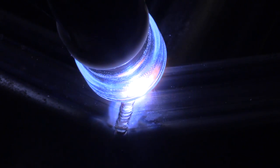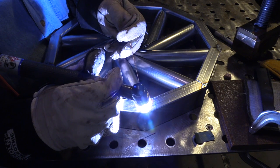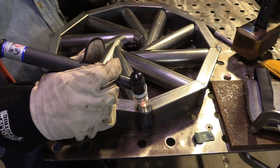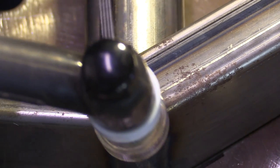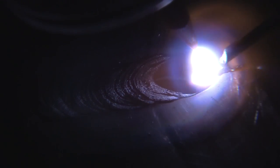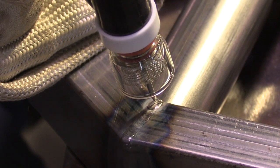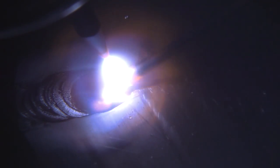I'm around 55 to 60 amps here. When you have a gap and you're welding thin stuff, you want to get the rod in there often — don't travel very far without dipping the rod in again. Without a gap you can move the torch ahead almost an eighth of an inch between dabs, but when you have a gap, if you try to do that it'll keyhole and blow a hole most of the time. Keep that rod in there really often and it makes things go a lot better.